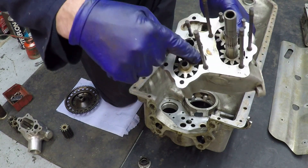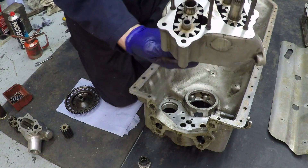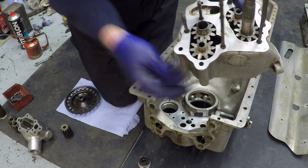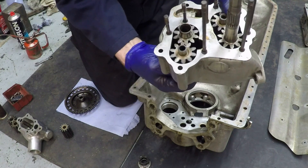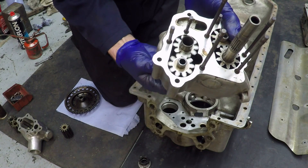The way they actually work is possibly not the way that people think they do. They actually run away from the outlet — oil comes in on this side, it gets carried around there and round there and then down there. It's kind of counterintuitive; they don't necessarily rotate the way you think they do.